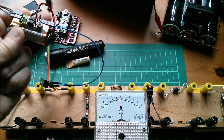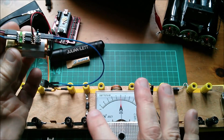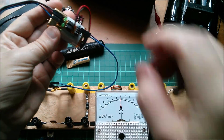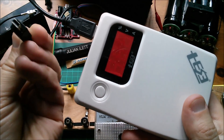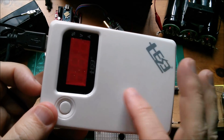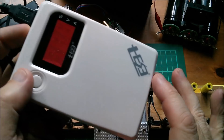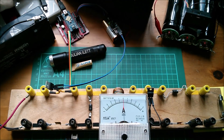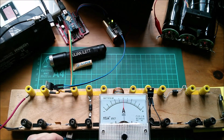So the one megaohm resistor, plus powering the Arduino from a power bank rather than my PC's USB port, should solve any problems of MOSFETs not responding correctly to their fly-by-wire control. Here's the power bank I'm going to use with a mini-B connector for the Arduino. This one can have auto-off disabled so it stays on - I don't want it shutting off mid-experiment. Switching on the power bank - I'm now under fly-by-wire control and can adjust the MOSFET driver with the pot.